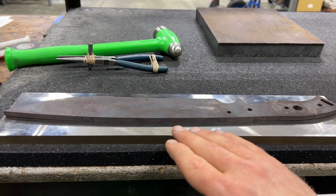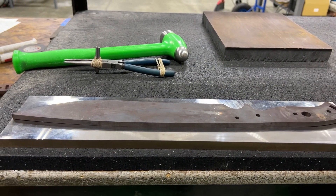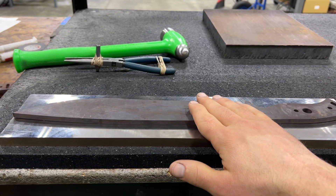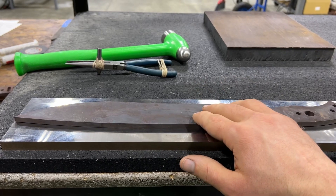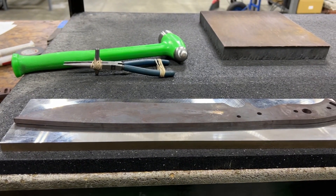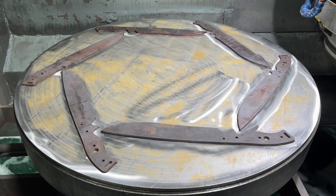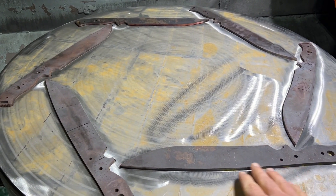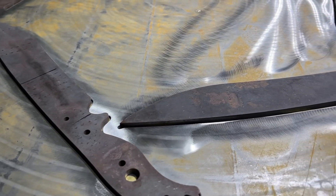These were surface ground by a third party. We were working with an outside vendor who was working with an outside vendor who initially surface ground these down just a little bit over size. I'm not sure what happened here but we're gonna get these fixed up and make them beautiful. We have a batch of parts flattened here, we put the Blanchard stencil on, laid everything out, and we're gonna grind side one and check back in a minute.